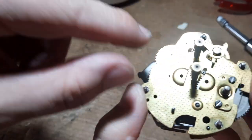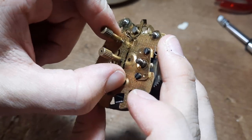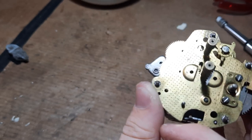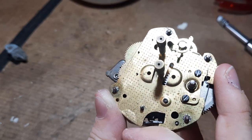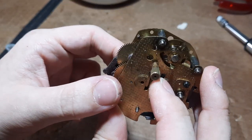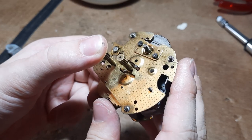Now around these pivot holes there is a lot of black residue - around this one as well there's a lot of black residue, and I think this hole might even be worn out a bit. The black residue - it's not oil, it was at one point, but now it's gone black and lumpy, so it's no good. In this current state it'll actually contribute to the wear, slow it down, become sticky, and if you keep it running it'll actually grind down the brass, which can mean your clock will stop running after a while and may need actual surgery.